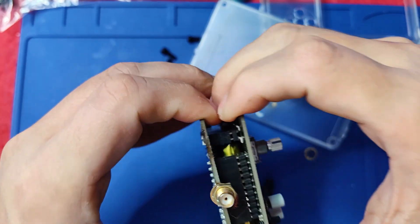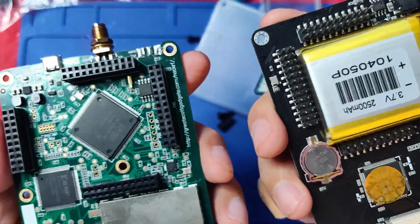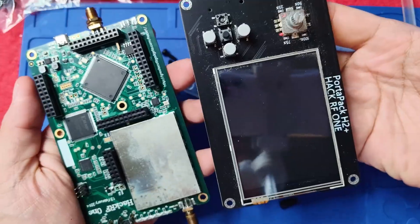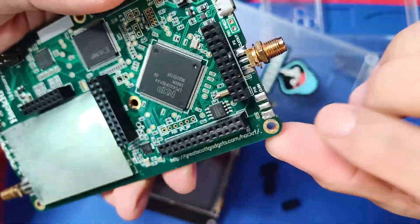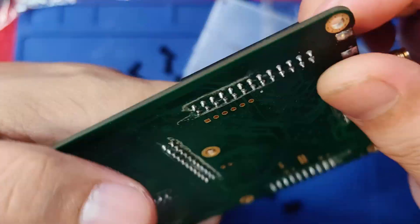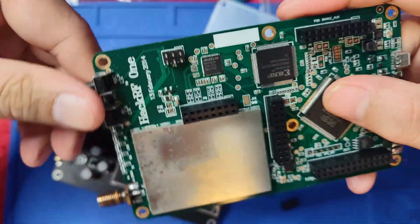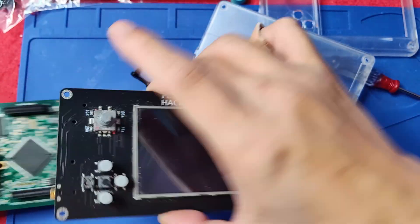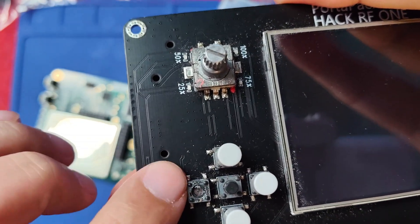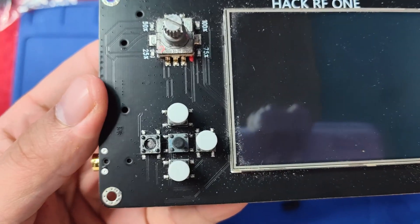As you can see, it is separating now. So this is how the separated HackRF 1 and Portapack 2 looks like. We will be soldering the SMA jack here — we'll be removing the solder there and replacing it with a new one. And we'll just be removing this button here and replacing it with a new one too, so I'll be coming back after I did that.